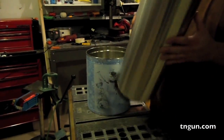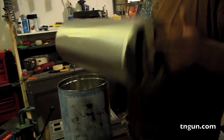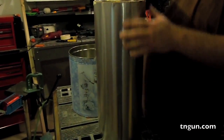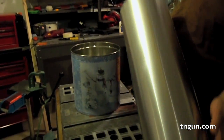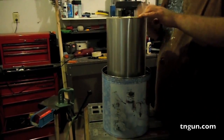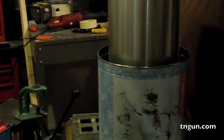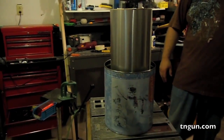Here's the tube — it's kind of flimsy. The instructions say to use sheet metal, but I couldn't find any and I'm not very good at messing with sheet metal, so this is aluminum flashing. I've got a 20 by 10 foot roll, cut some off. It's kind of fragile, but it's supposed to be, because when you're done you've got to be able to take this apart. It just fits down here and you ram the refractory mix around it — sturdy enough for that, but you need to be able to take it apart.